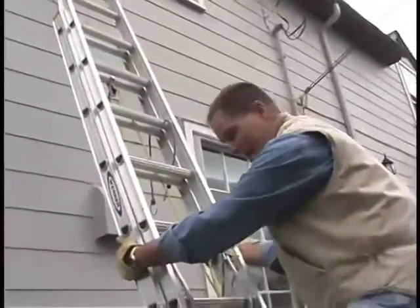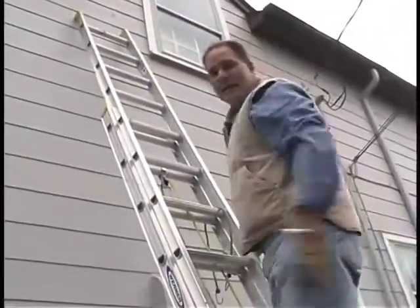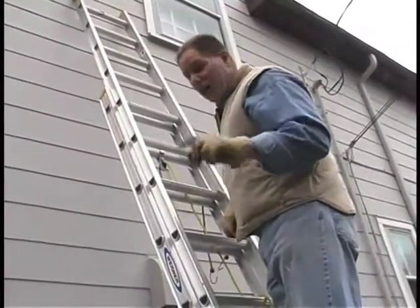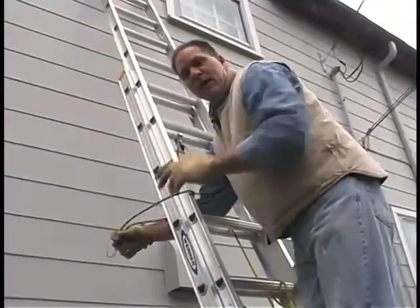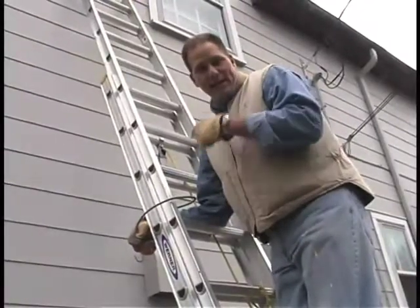Take your time, grip with two hands as you work your way up, and make sure that it's placed firmly against the side of the house. Remember this — if you're going to tie off at a gutter, it's very important to use a bungee cord to tie off the ladder on each side, two of them. This extra step is going to make sure that you're safe when working on extension ladders.